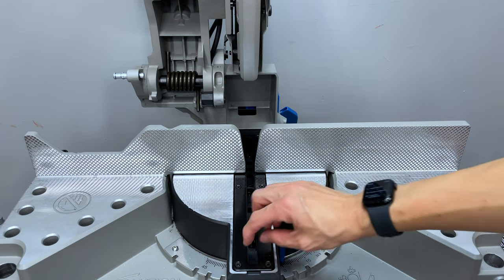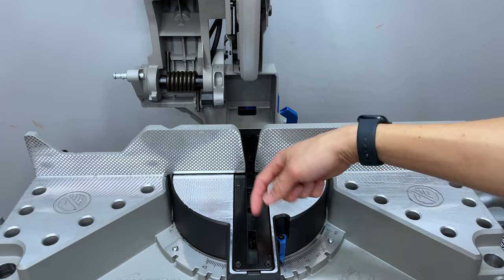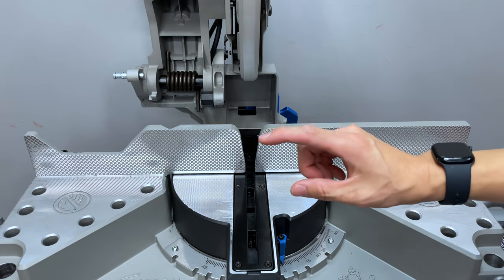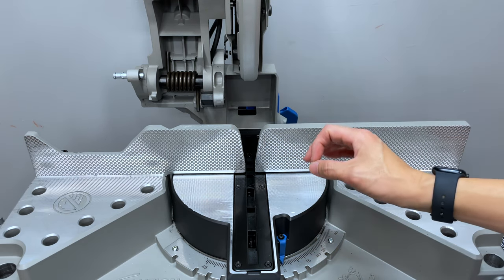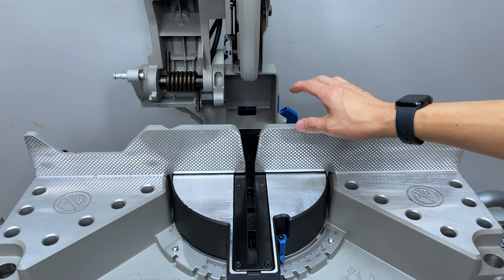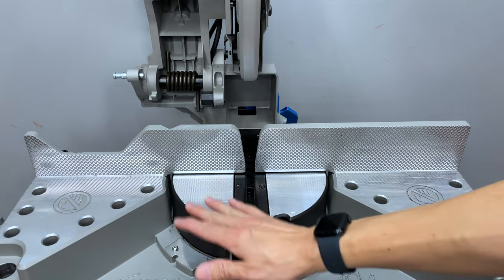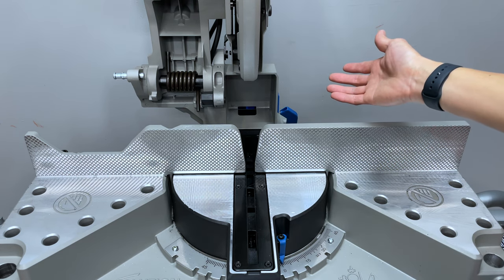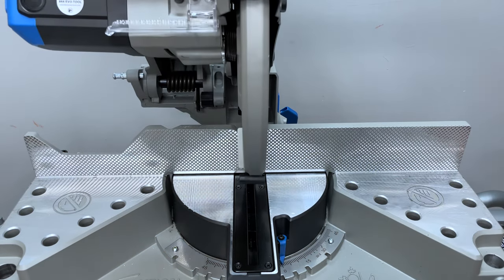This blade slot isn't zero-clearance, which is why they don't want you cutting very small pieces — they'll go flying or get caught. The theory is that metal shavings should fly into the collection area here, but in reality it doesn't work that well. Honestly less than half the material ends up in there — the rest goes flying everywhere, even when cutting in the best position. The idea is nice though, and you could put a bucket down there.